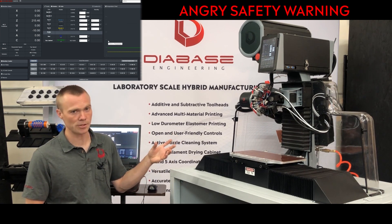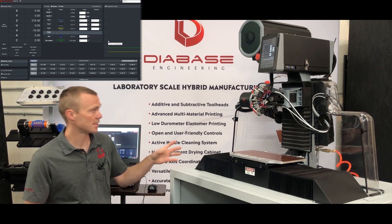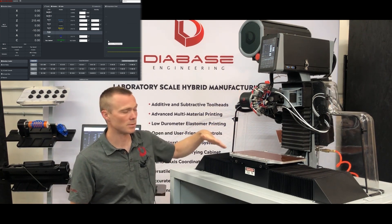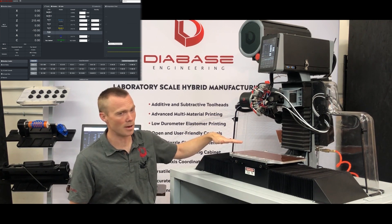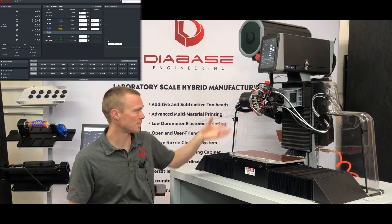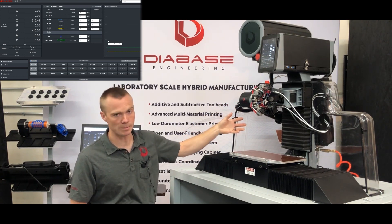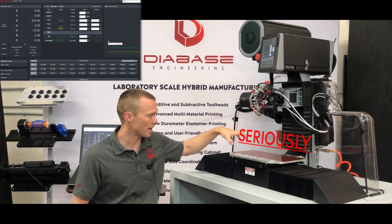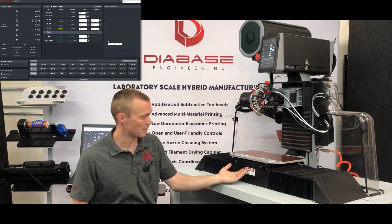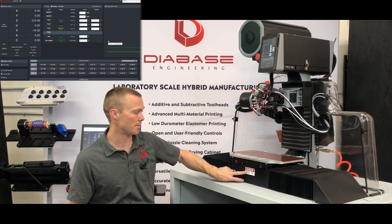There are multiple points where you can get pinched or get your hands crushed on this machine if you're not being careful. The first is the Z axis — it's a very strong axis. X and Y are driven with a 10-to-1 ball screw; the Z axis is 5-to-1, so it has to be powerful enough to lift this arm and move it quickly, which means it is powerful enough to hurt you. Keep your hands out of this region whenever the machine is running, and especially away from the Y axis.